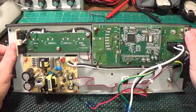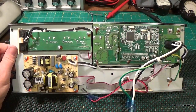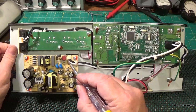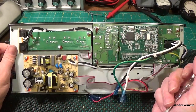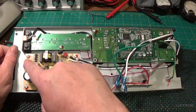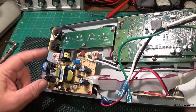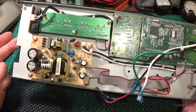This is the underside of the amplifier. This is what's called a switch mode power supply, and in the UK from these wires we'll have 240 volts coming in. You consider all this as dangerous — and it is. Even when it's unplugged, these two big things here, which are electrolytic capacitors rated at 200 volts, might still hold a charge. So just be careful.